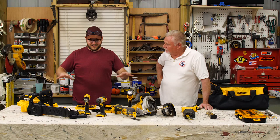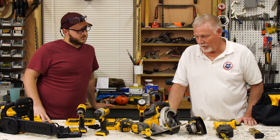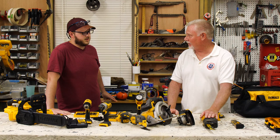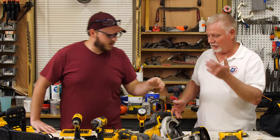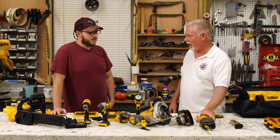After talking about everything here, is there anything you'd rather use or go back to? Or is there something not on this table that you'd need to get something done? I really think the main thing is still these two guys — the drill and the driver — and some type of a saw. If you could only have one saw, I'd probably take the reciprocating saw. I was surprised at what that can cut through — if you're skillful enough, you could cut a piece of plywood that wide following a line. We used it to cut through seat bolts on the floor of the bus, and you can use it to shear right through two-by-fours. In contracting, this thing is invaluable. If there were three things, it'd be the reciprocating saw and these two for sure. Everything else is a luxury.